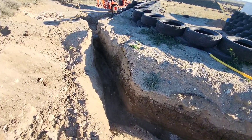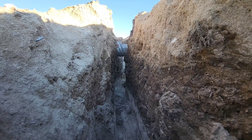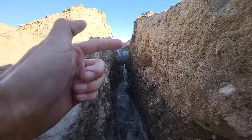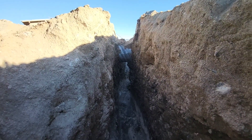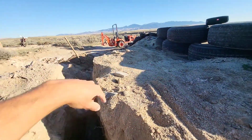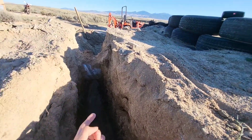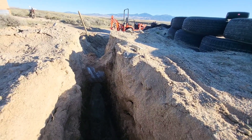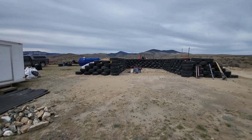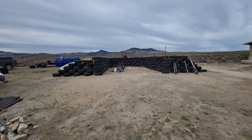It's the end of the second day digging the trench — I'm pretty much all finished. It probably took me about 10 hours of work between the two days. I just dug around that cooling tube, and when I go to put the blueboard in I'll cut out a notch so it'll be insulated all the way around. I did not insulate the inside towards the building — usually you'd insulate around the whole tube so it doesn't act as a thermal bridge, but I decided to leave it since it's nice and compact. The full insulation is actually all done now about a week later, and I'll save that for the next video.